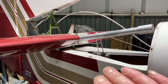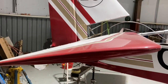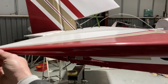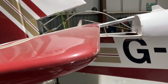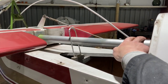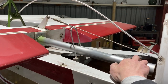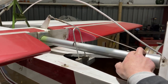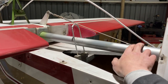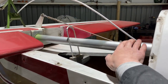It's become apparent we may need to have a talk about mass balancing of aircraft control surfaces and the purpose of it. This is an all-moving tailplane on a Robin aircraft, and this is what people refer to as the balance weight, which sticks out in front of it on a long tube. Quite a lot of people, including some pilots, believe that the purpose of this balance weight is to balance the weight of the stabiliser, help the pilot out with control forces, effect a trim change, and prevent the weight of the stabiliser from pitching the aircraft nose down.